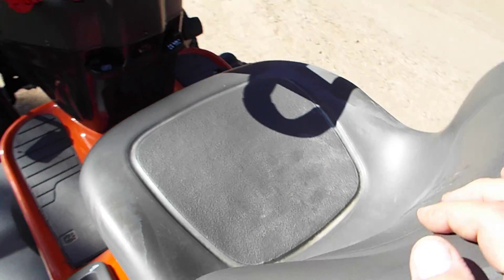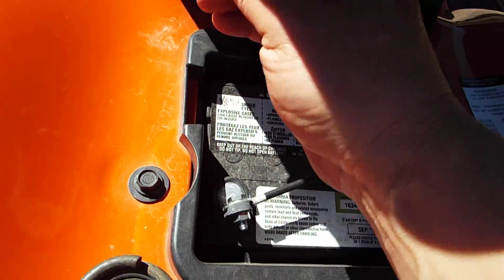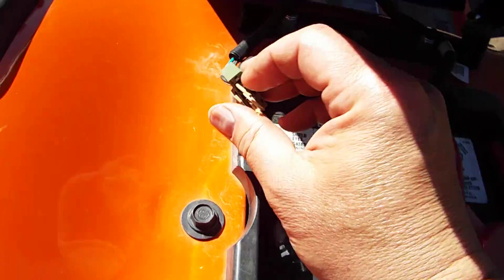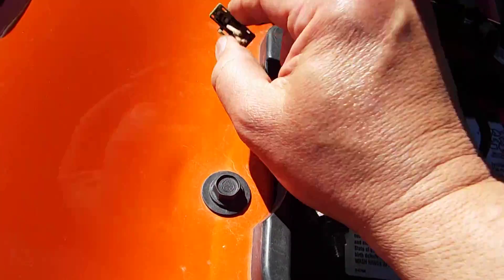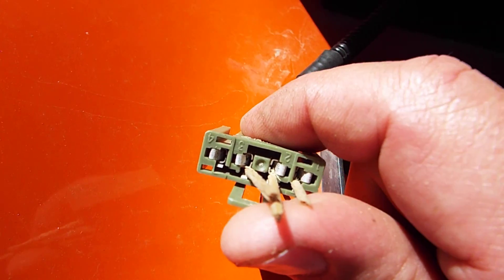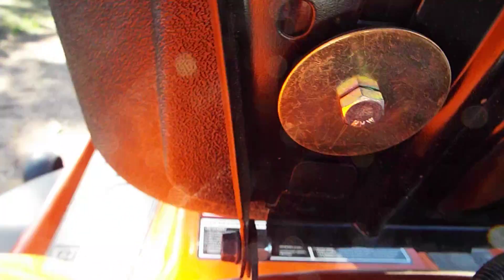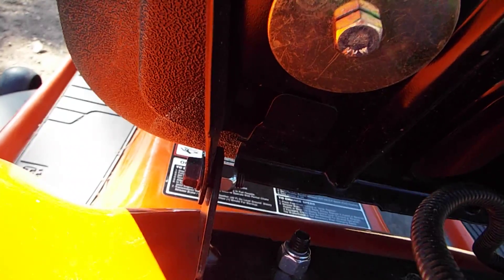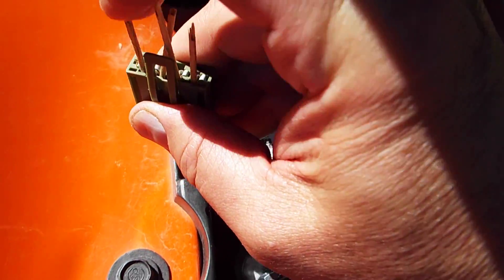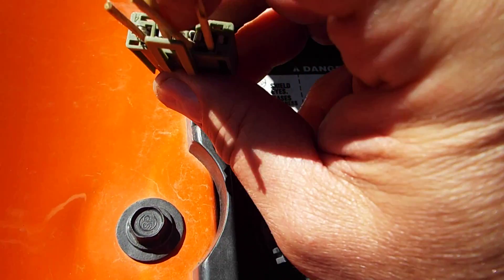So what I've done is I've bypassed the seat sensor. There's a little bar when you pull this little connector off the bottom of the seat sensor. You can see these little toothpicks in here — there's a little tiny metal clip in there that shorts the seat sensor out, so you can't run the tractor with the connector off. What I do is take some toothpicks and push them in to separate that little metal clip from the connector on all four of these.